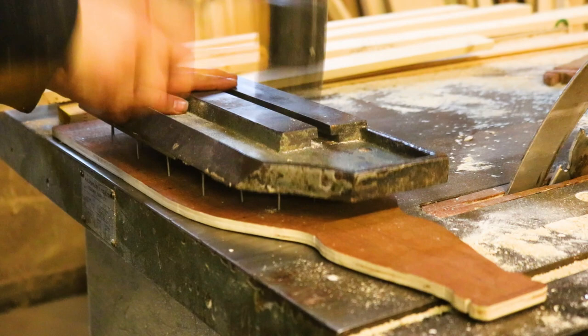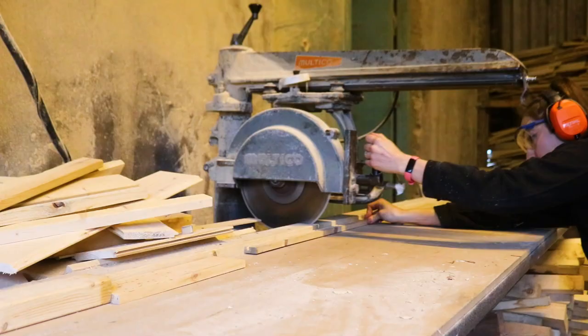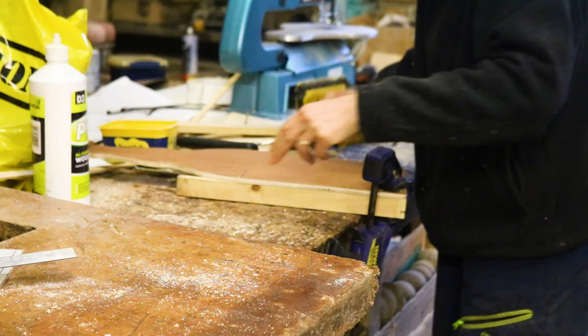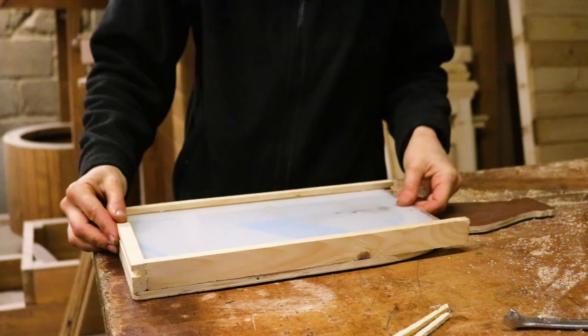Next I'm working on creating some side trims, but I needed to cut a recess or a dado for my Perspex panel to go in. At home I'd just use a router bit for this. Then I could pre-drill and screw that to my beer bottle shape. After cutting some Perspex down, I could slot it in and glued some shims either side to stop the Perspex cover from dropping fully down.